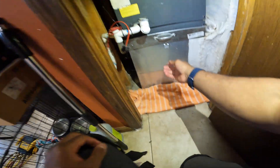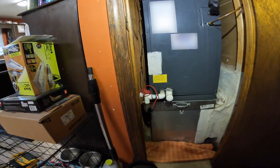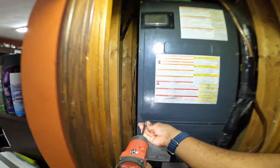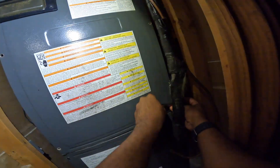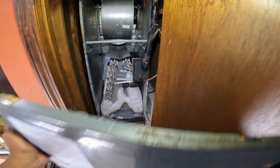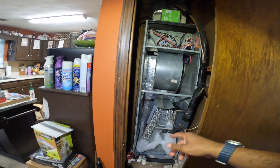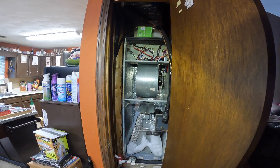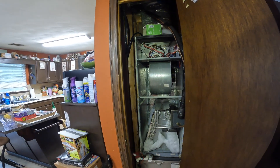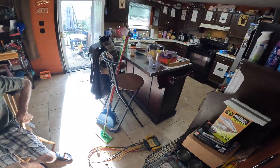So this is it. You said the filter was pretty bad. I forgot my drill — I got all that stuff and forgot my drill. Let me go get that. Hopefully it's just the filter. Yeah, the bottom half is still frozen. Quite a bit of ice buildup. It could have been the filter, but with the amount of ice it might be pressures. So I'm going to let this melt and then put the gauges on the outdoor unit.